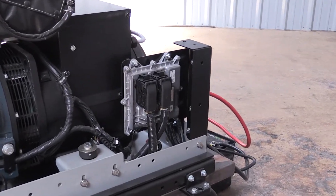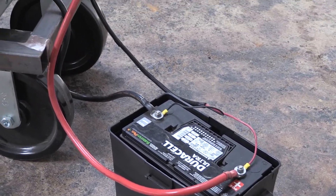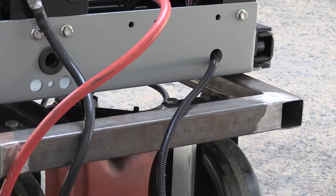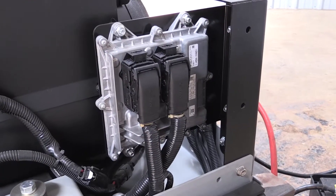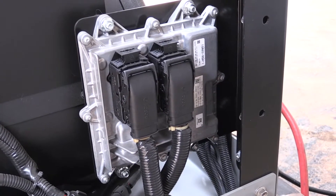Since these engines are controlled by an ECU, there is a special battery home run circuit that must be installed between the wiring harness and the battery itself. This is crucial to eliminate voltage drop to the ECU while starting and allows the ECU to shut down properly once the user stops the unit. Details about this connection are on page 19 of the installation and maintenance manual.